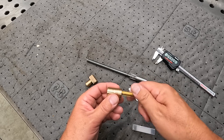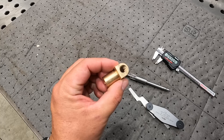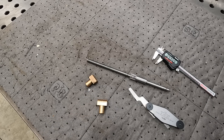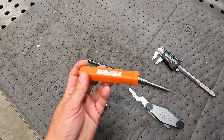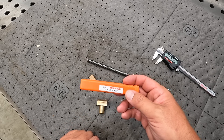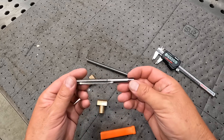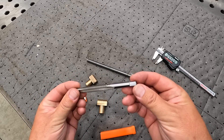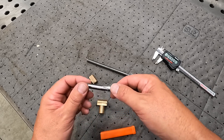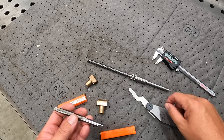We can tell that the thread pitch is the same, so the easiest thing to do is to have a tap and run it through this new nut to clean it up. I actually bought a 7/16"-10 left-handed tap. This is the first time I purchased a tap off Amazon — it was about $27. I've never needed a 7/16"-10 Acme tap until today. Upon inspection, this is not a bad looking tap at all. It's supposed to be high speed steel, which is what you want — some cheap taps are just regular carbon steel, no good. It just has a good look to it, like some quality was put into it.